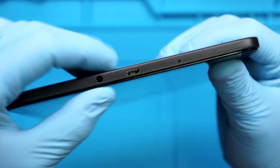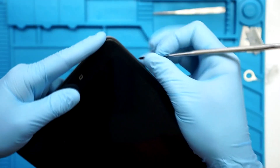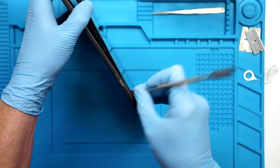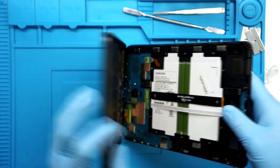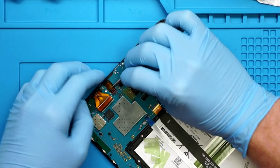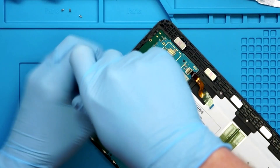On the T580 you're going to want to use a metal tool to remove the back housing. You'll fit it between the bezel and the back housing edge to kind of pop it off of its clips, and eventually it'll come off as long as you're careful. Just work slowly and make sure that you don't pry it too hard — it'll come off pretty easily. Remove the battery and all the other flexes, remove the front camera, and then start to remove the screws.